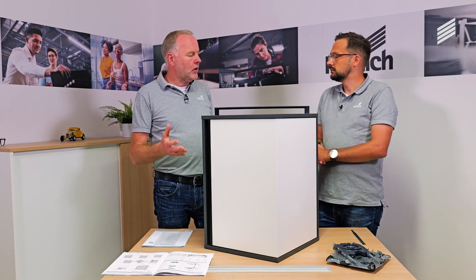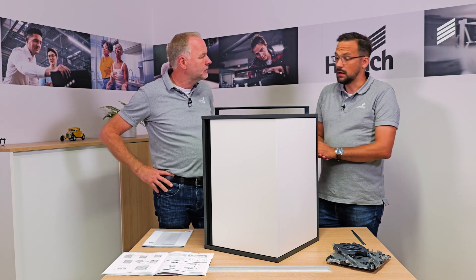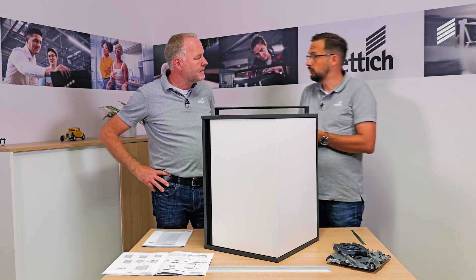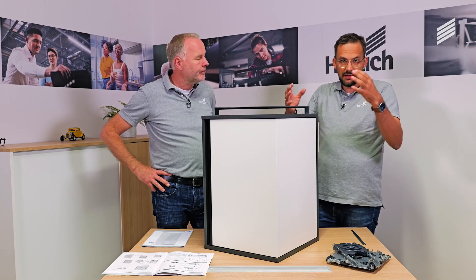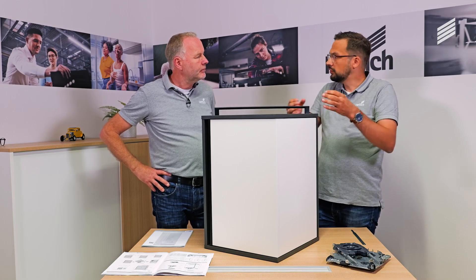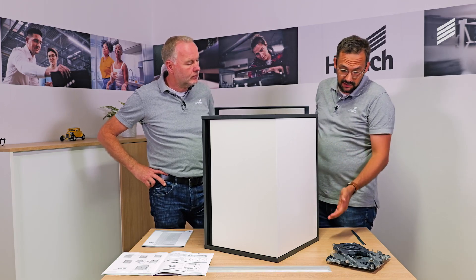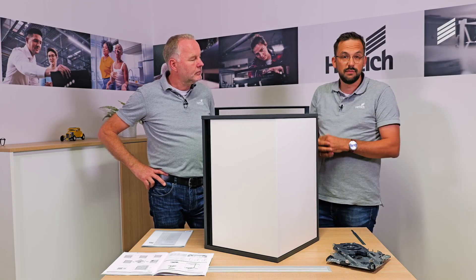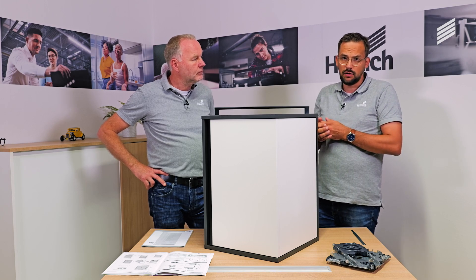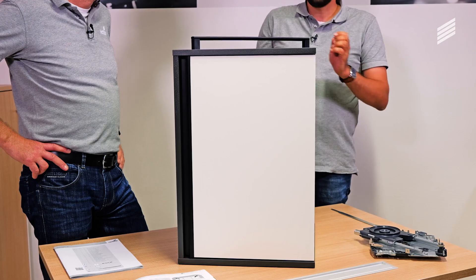With the Fernspin carcass, I always think of a standing solution on pedestal feet — but can I also hang it on the wall? There is the possibility to put the Fernspin on base feet; then you need a fifth foot in the middle, because the total weight of the rotating element concentrates downward in the middle. You can also plan the furniture as wall-hanging, but you have to make sure to stiffen the carcass at the bottom — it may lie flat or hang on the wall using wall hangers and an additional stiffener — because when opening, all the force presses on the outer corner and it must not sag.